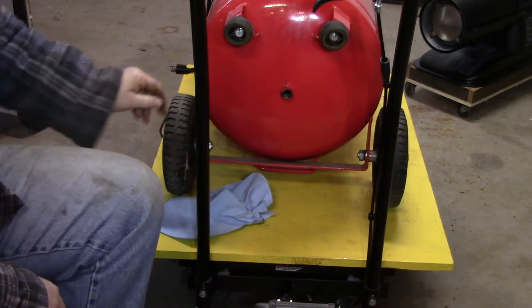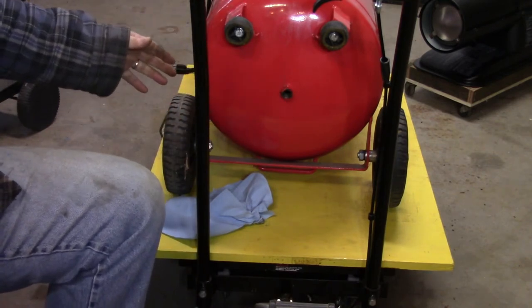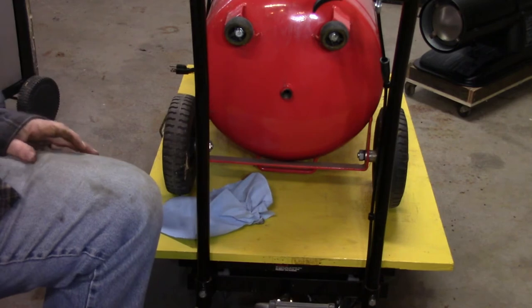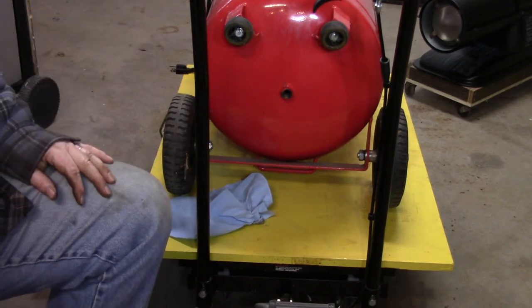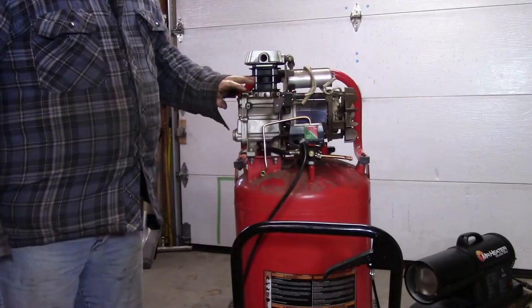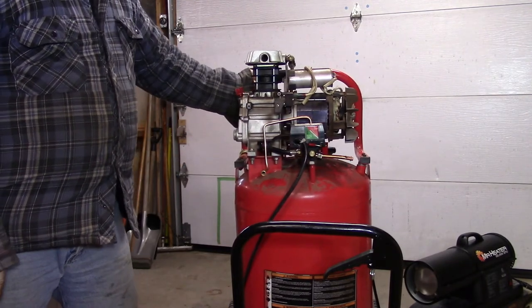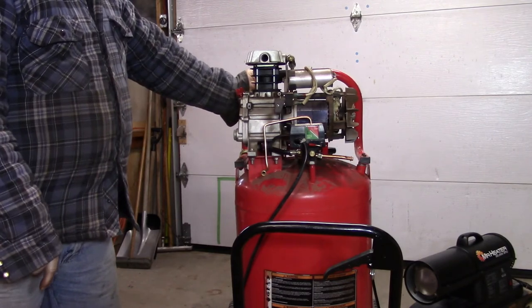I'm going to put the plug back in the bottom for now, but I want to put an elbow in here so I can connect a hose to it — it'll be easier to drain the fluid. Right now the drain valve is way underneath the tank when it's stood up straight so I tend not to drain it. But if the hose is out the side, it'd be simple — just let the hose down, open it, and drain off. I'm also going to drain and change the crankcase oil. I don't have the fittings yet so I'll put it back together and leave it like that. I'm not an air compressor maintenance expert, that's for sure.